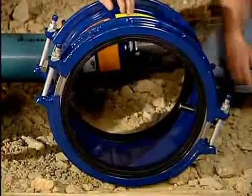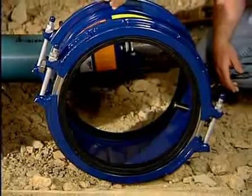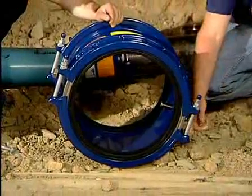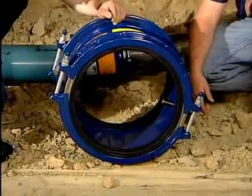It's still a stab-on product, it's still got the two-layered gasket for range adjustment, but it does have a bigger diameter bolt that provides a higher level of gasket compression against the pipe wall on the end rings.